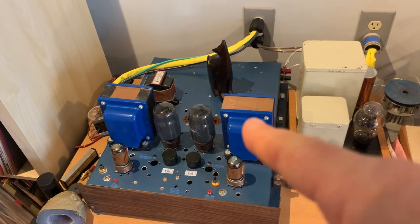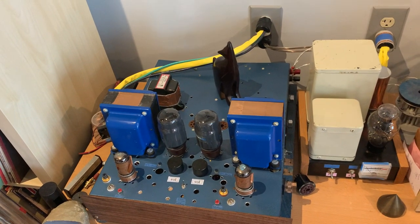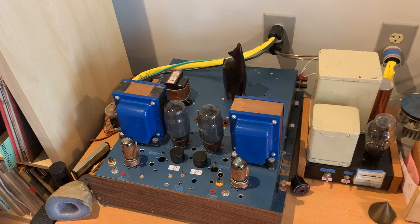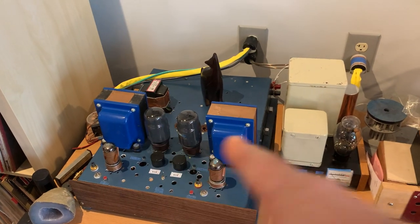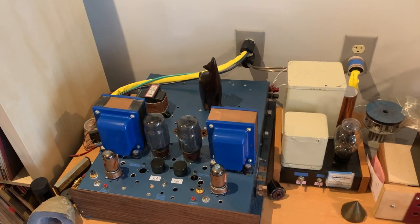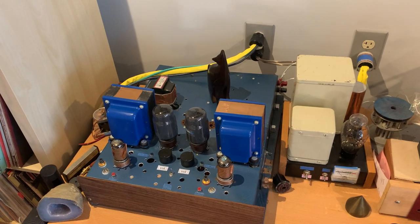You see the output transformer — this is a 30-watt single-ended iron. It is 5 kilos each, or 10 pounds each. If you say 30 watts that doesn't say a lot, but if they were push-pull output transformers, each of them would be about 200-watt output transformers of this size. Even though this amp is so big and heavy — the chassis is made of 3mm thick aluminum — if I pick it up, the chassis actually bends under the weight of the transformers inside, even though it's a pretty sturdy and very strong chassis.